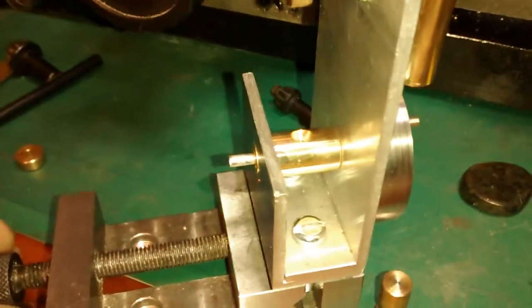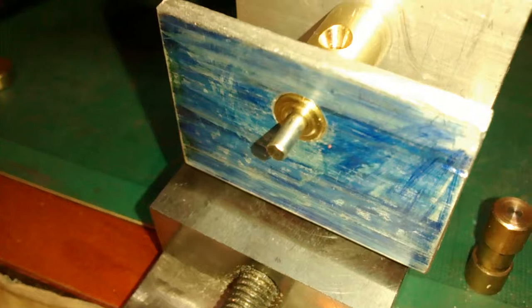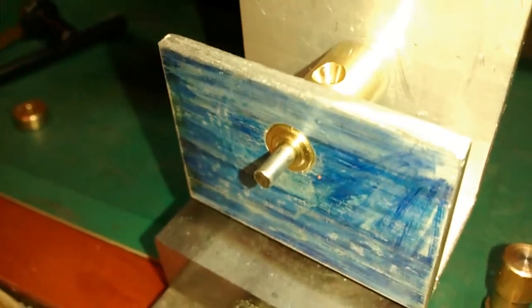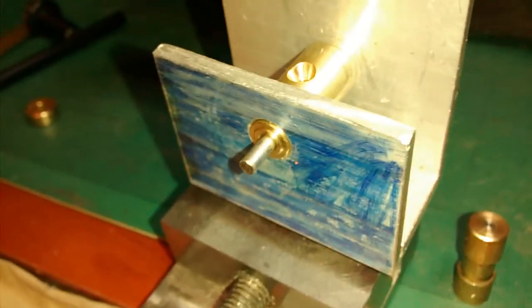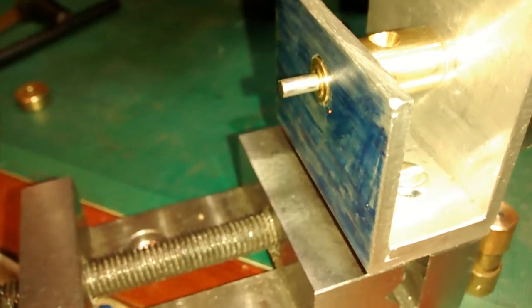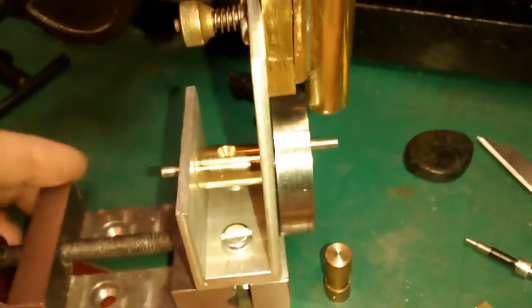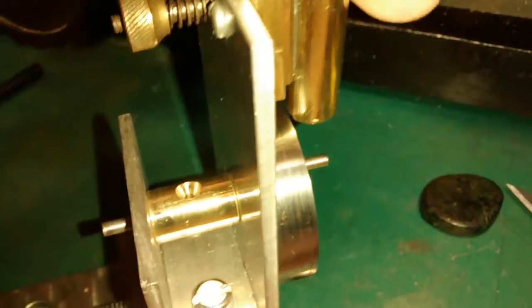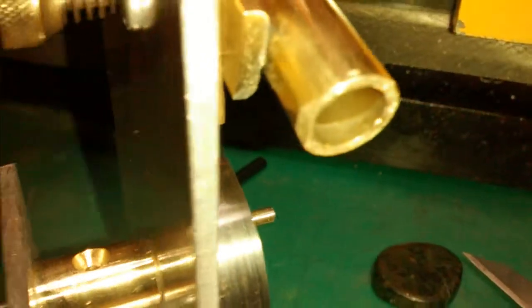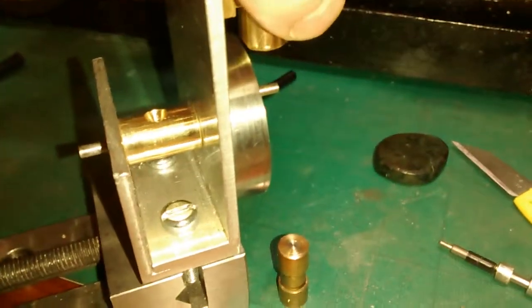I have a bearing made and I have put an oiler hole in it. I did the bearing project about a millimetre out from the plates of the frame, and there is just a small shoulder to reduce the friction. I had one on this side only — the clearance was very, very tight. In fact, you can actually see that I've had to file a small angle on the bottom of the cylinder just to make sure it clears the flywheel.